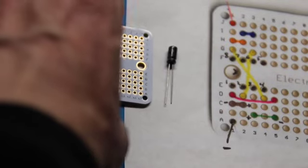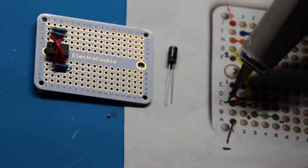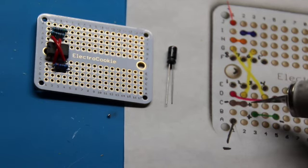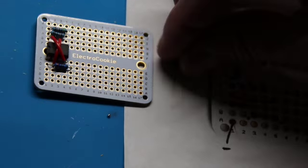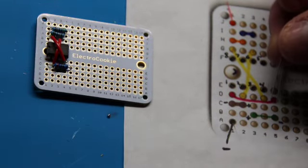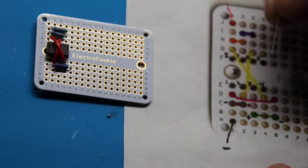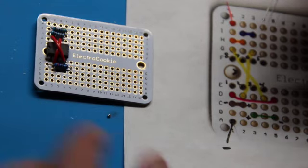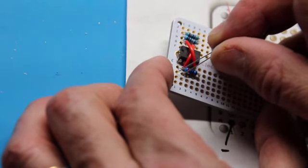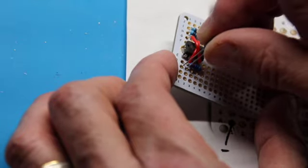So, in our particular circuit here, you can see that I've marked negative at this C1 part and positive at the C2. That means the short leg of our 4.7 capacitor will go at the C1 and the longer leg will go at the C2. So let's place that. C1 and C2. Make sure short leg, yep, short leg to the left, long leg to the right.